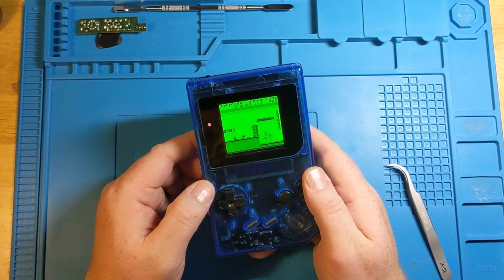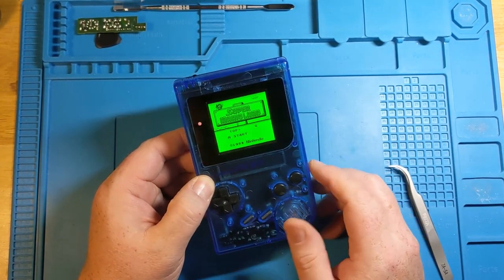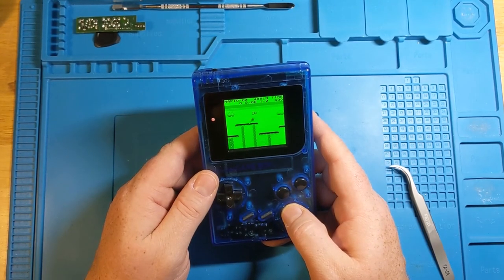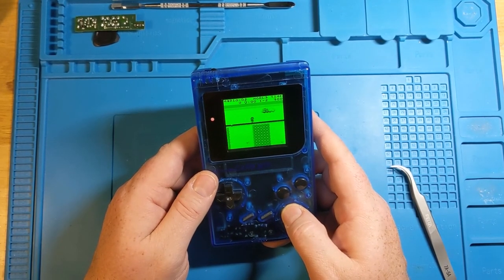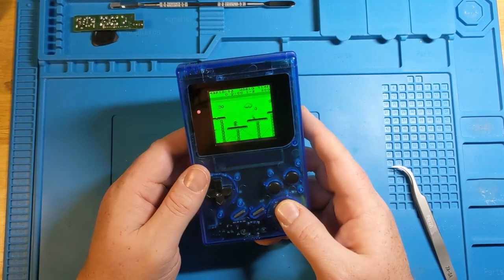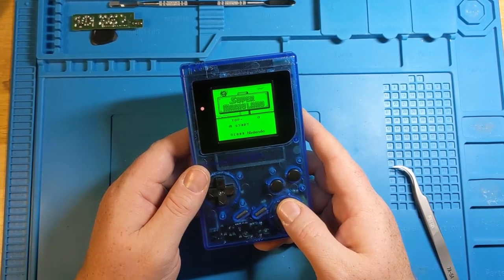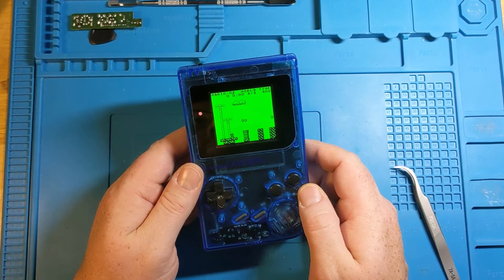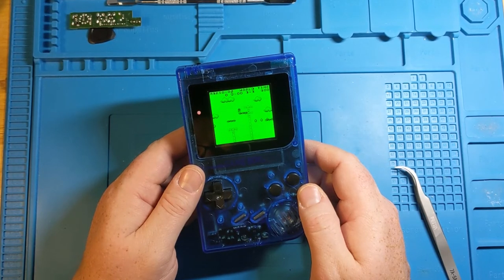Now, I'm kind of partly cheating because I have the new RIPS DMG V3 screen in this guy. And because this is already running off of a completely new front PCB, it's already doing some of the power processing work here. But a lot of what I've read about this says that if you actually go into original ones that have a bivert and backlight, it actually ups the contrast. So I'm definitely going to experiment with this a little bit more. I'm not going to uninstall it from this one, but since they're actually fairly reasonably priced, I'm probably going to snag a couple more of these and put them in my other units, because whether I end up selling them or keeping them for the collection, either way, they're actually going to just run better. So, yeah, that is my full review of the Clean Power V2 power regulation board for the DMG.